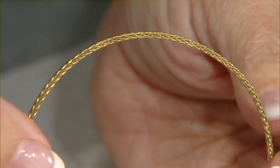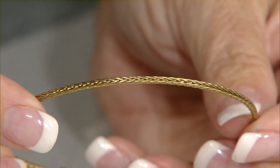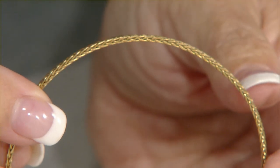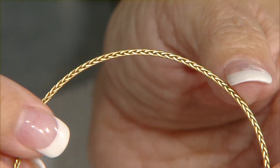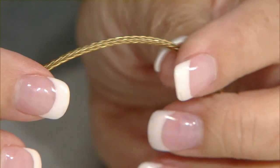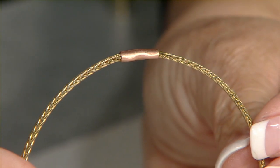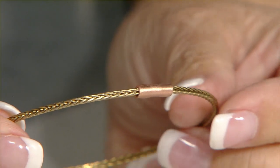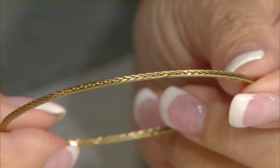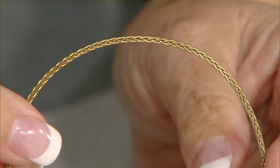Yeah, now this, if I would have known into the future that we were going to have an actually braided wire, I think we would have named the artistic wire braid something different. But now we're kind of stuck with it. So this wire is actually braided. It goes on a braiding machine that's fascinating, and 8 wires become all twisted and tangled and braided together. After that braid wire is done, it's sent through the oven to remove any of the oils that have to go on it because of all of the machining that goes on.